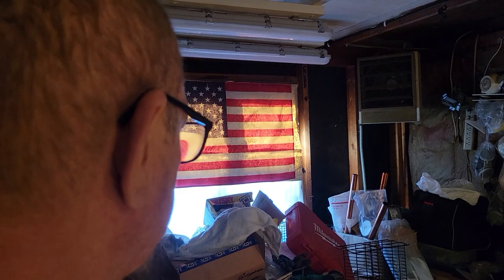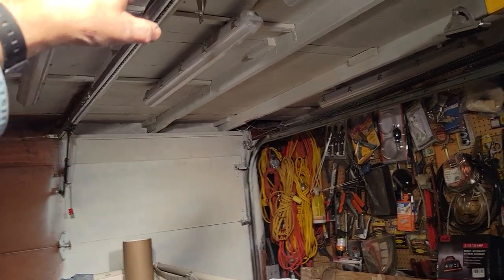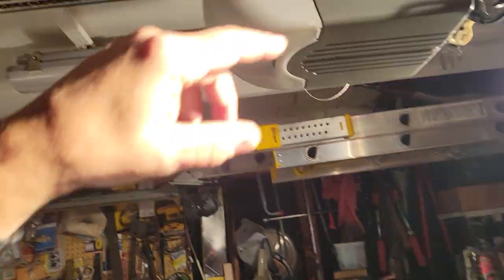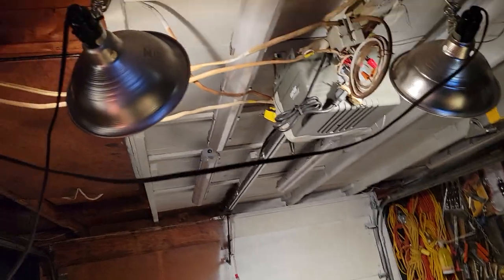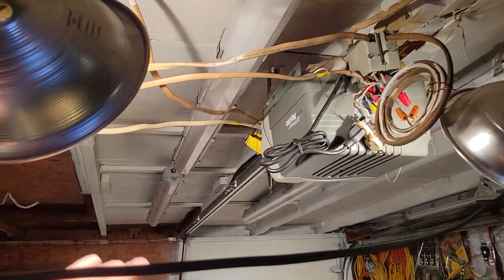I've got those zero-to-ten volt dimmers and I've got to factor those in. I've got all these plates spinning. I'm going to put a 5-amp garage door circuit and my switch to the lights for my LEDs upstairs, and fans to cool off the copper tubing for my compressed air cooling. I've got a couple of craft fans, so that's a 15-amp circuit. This is a 5-amp motor and I've got a 15-amp metal receptacle — I'm going to put it right here.